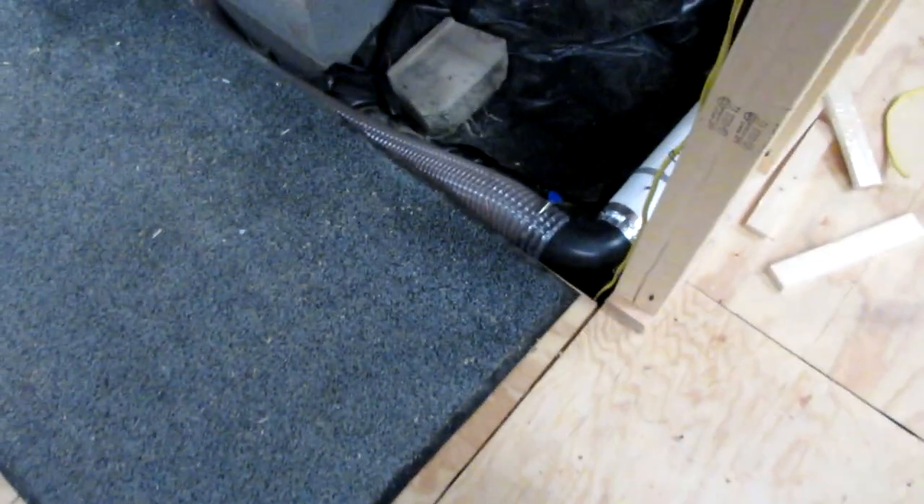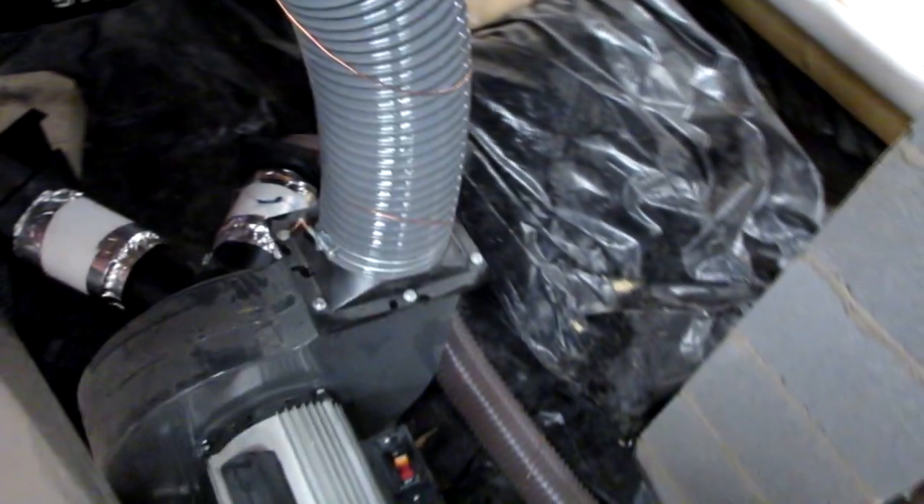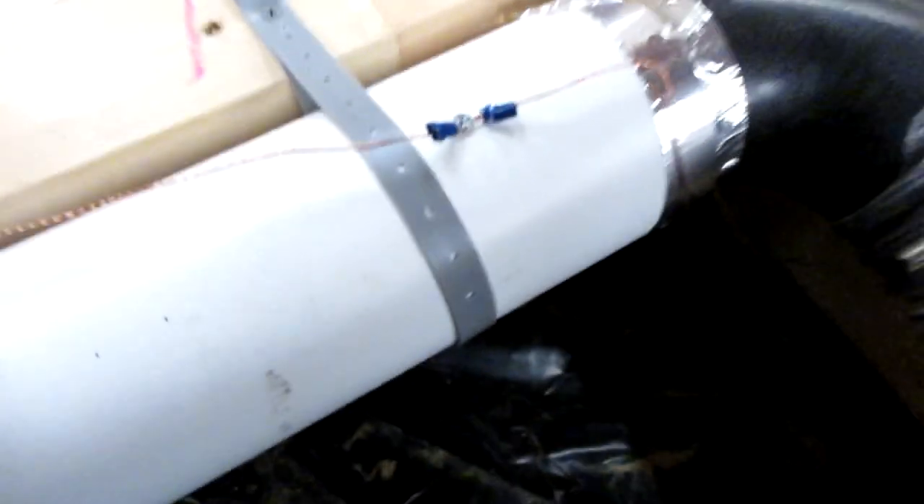We're all done. I started with the copper wire — I ran it out of the box, all the way up, brought it back down to the bag holder, wrapped it around the slinky pipe, and then tapped into the PVC right before the blast gate. Wrapped around that slinky pipe and kept tapping in at each point along the PVC.